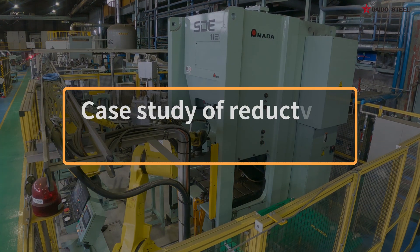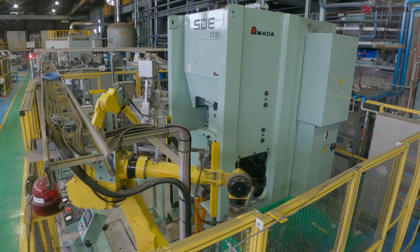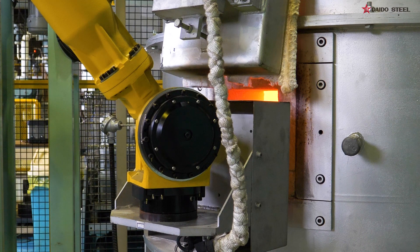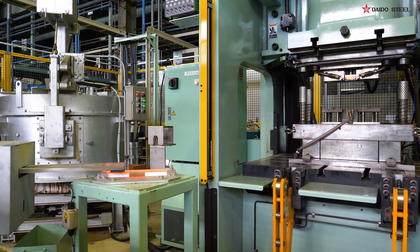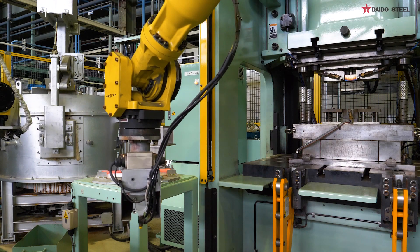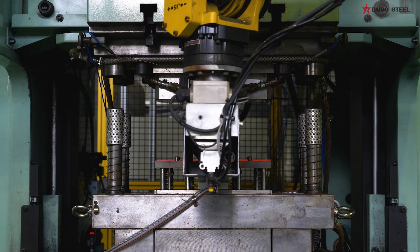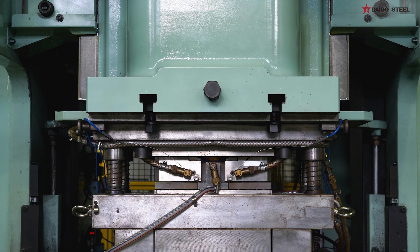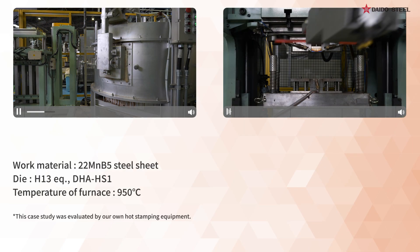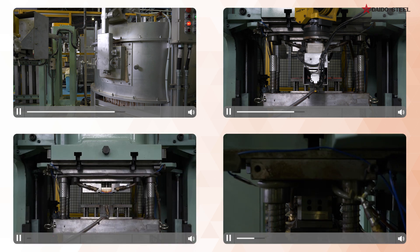Let's take a look at its performance. The heated steel sheet is sent to the die and formed by the press. The steel sheet is held at the bottom dead center for cooling. We repeat this process for 15 shots and evaluate die temperature at its saturated state.